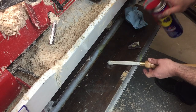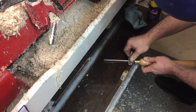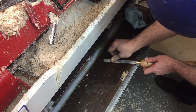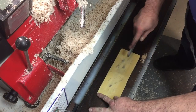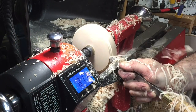For parting tools, I'll use some WD-40 with 2000 grit sandpaper just to knock off some of the burr on the edges from the 60 grit wheel that I just sharpened on, and then smooth it out with a piece of leather. And here you can see that is much better.